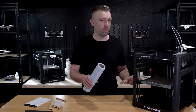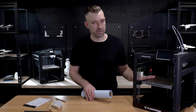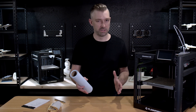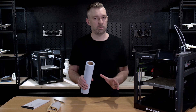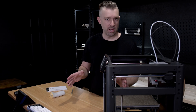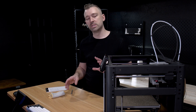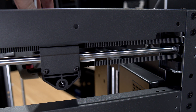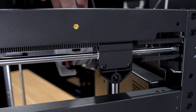The one note is don't use paper towels to wipe down your bed — find anything else. An old t-shirt and a pair of scissors will do perfectly. Also, while you're wiping down your 3D printer, you want to avoid touching the belts or the rails. These are two areas that you want to address independently and for two different reasons.